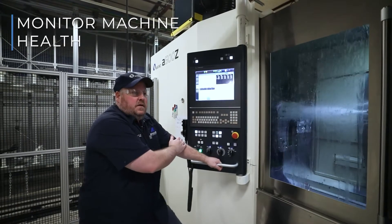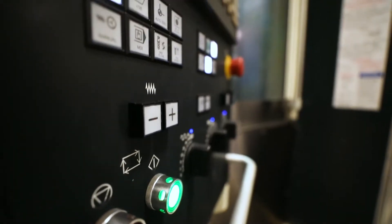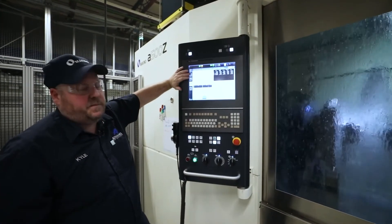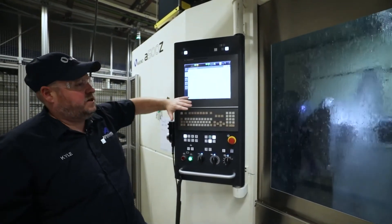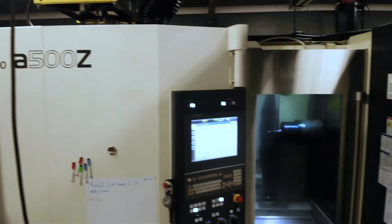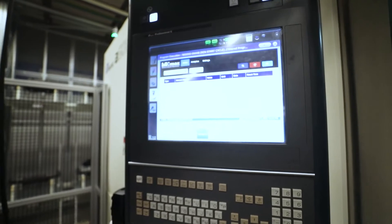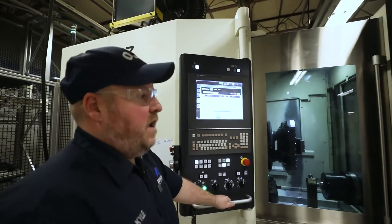It's allowed us to monitor our health and for preventative maintenance on our machine tool. Some of the features I really enjoy about the Pro-6 control is having these touch keypads—quick code buttons for the operators and the machinists. You can just touch on it and it takes you right to your tool page, all your offsets, your part programs—all the information is really quick and easy. And this is our MH-Max. We click our home button, and it does an analyze, and it's bringing us up to what it's monitoring.